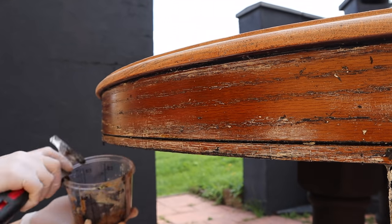What I'm doing now is sanding it down with a 120 grit instead of wiping it down. So there are two different techniques in this video — figure out what works for you. I took a 3M pad and I'm going to wipe that and expose a little bit more of the wood grain. You can tell on the legs I left a little bit more white around the edges, which is the look I wanted. You can try either way — if you have a more ornate piece, this sanding technique may work better for you. If you've got a flatter area, I found that what I did on the top worked a little bit better.